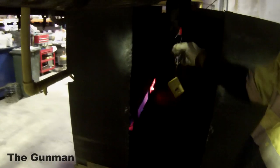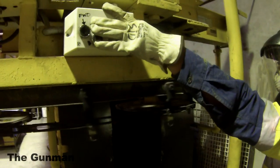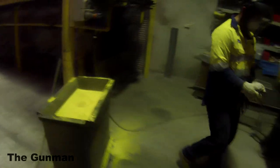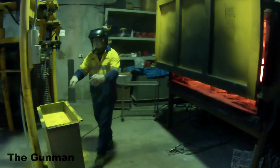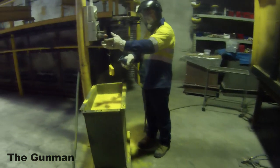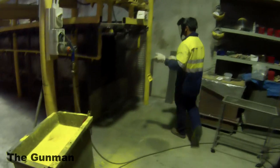Here we are doing the process of getting the coating on. You may have noticed he just pulled them out of the pre-heating oven with the hook, dipped it into that aerated plastic bath, pulled it out, then got the air pressure onto it — just a low setting, maybe around five PSI — just to get any of the powdery dust off. Then he puts it in the final baking oven, which will flow all of that powder out. It really is very powdery and coarse — a pretty terrible finish if you were to just leave it like that without putting it into the final bake.